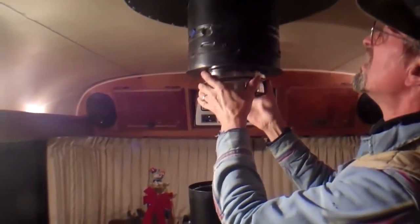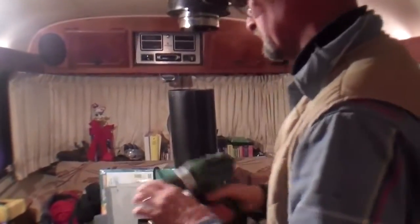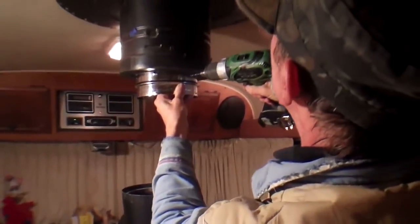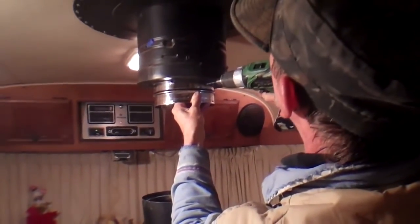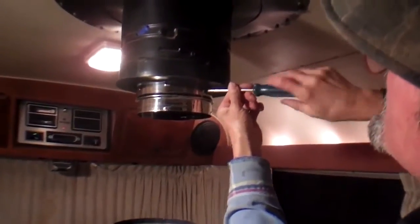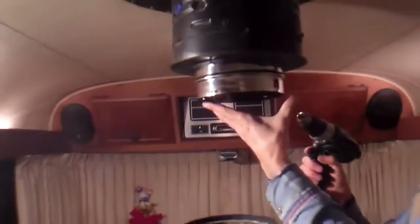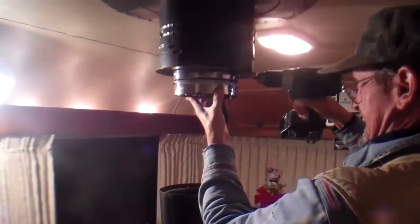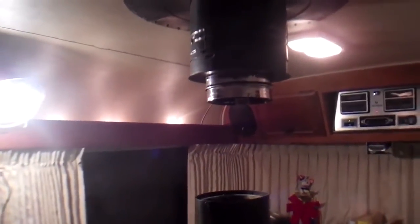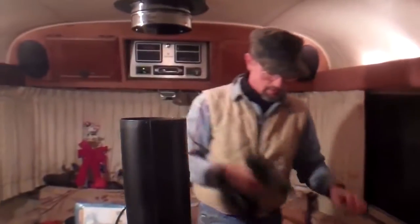Casey will show you how it goes — it's a nice tight fit and you just put it in and use some screws. The trick to drilling stainless: take your time, go slow. Even if you have self-tapping screws, normally they won't go through if you rush it. We're all done and have a nice firm connection. This pipe has now been modified to accept the Simpson, though this adapter style is actually obsolete and being phased out.